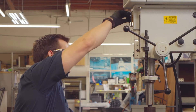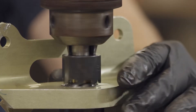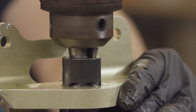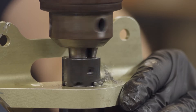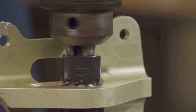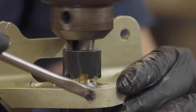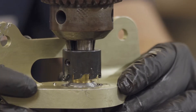Turn on the drill press machine and slowly feed the cutter into the face of the bearing. Observe the chip formation to ensure that the chips remain non-discolored. A dark or blue chip will indicate that the machine is running at too high an RPM or that you're feeding too fast into the face of the bearing. A gradual peck feeding is allowed between 5 to 10 thousandths per peck. Between pecking cycles, brush and remove chips from the cutting teeth and the face of the bearing.